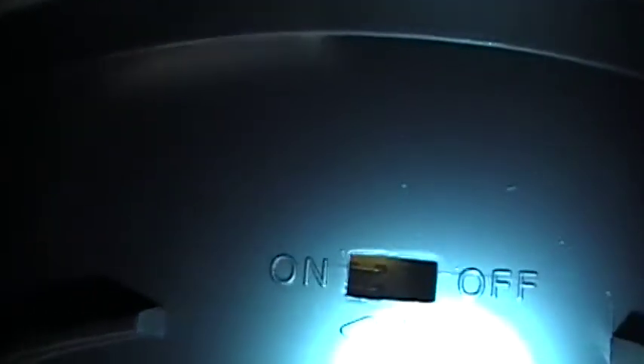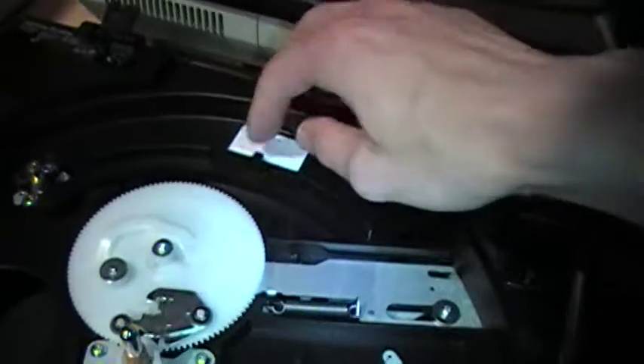But if you look in there — I don't know if I can get the angle just right — you can see there's a jumper in there. So it still has the capability to turn the preamp off; it's just hardwired on. So if you wanted to use this Pioneer for phono input, you could just install your own switch there and switch it off. That's what the Sony has, so that's the only difference there.